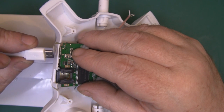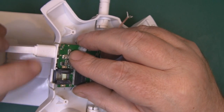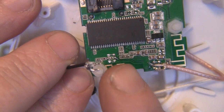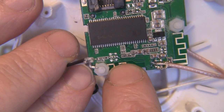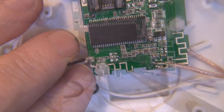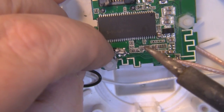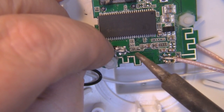A little trick to make sure it's all lined up is to get the USB cable and insert it into the port itself - that'll help hold it in place until the epoxy is set. I've soldered the single coax in place on this side of the board that leads to the bi-quad element. For the two coaxes for the dipole antennas I've twisted the centers together and soldered them in place, and the outer braid I can tack down onto those two solder points which connect to ground. I'm going to solder the main signal wire down first - I'm using a soldering iron with this size tip. A little bit of solder on the end of the tip and a little bit of heat in there to get the solder to flow.